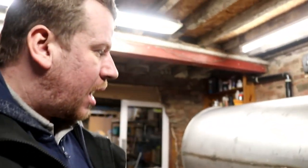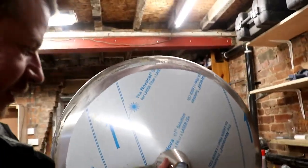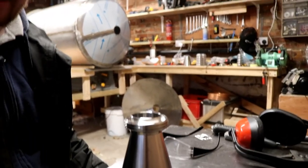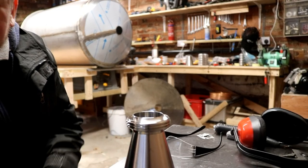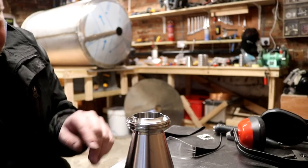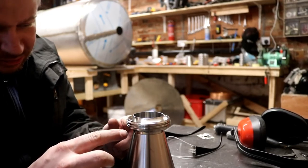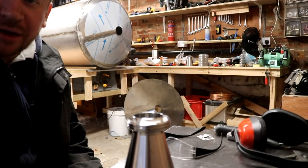To give us a job tomorrow, I want to get the cones — as many as I can — on the tanks. These are the concentric reducers that we need to put on the bottoms to get us down to a 2 inch fitting, to get us down to a 2 inch outlet. I've only got 3 so I'll have to do the other 2 when they arrive. So just here is one of the fittings. What we need to do is tack this male piece onto this concentric reducer, and once that's on we can turn it on its side, purge it with argon gas, and start to weld around the perimeter. Then once that's done I have to weld the whole thing onto the cone in the background.